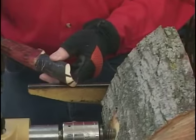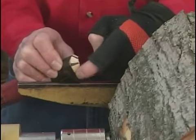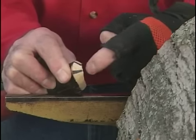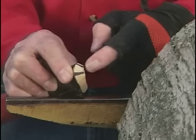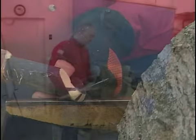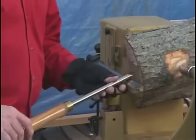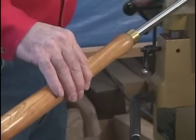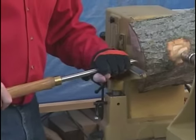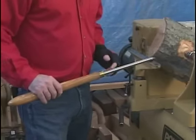One of the most important things we need to think about is where the bevel is. The bevel is that little real estate from the heel to the sharp edge — there's a straight line, and it can be a little hollow ground with the grinder. There's a line between the heel and the toe that gives us the direction the tool wants to go, and we're going to use that and let the tool go that direction. You need to know where that bevel wants to go and have it parallel to the tool rest. The handle has to be back on an angle. If you come in straight, the bevel is not going to be on the tool rest — many people do that cut and you really have to just hang on for dear life and white-knuckle your way through. I want to show you how little energy this takes.